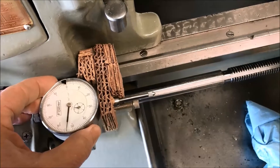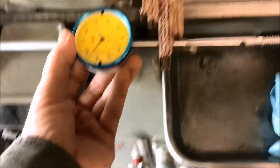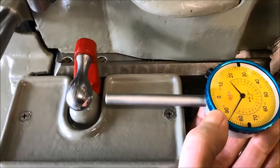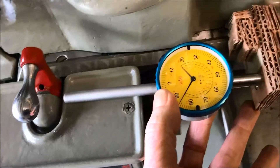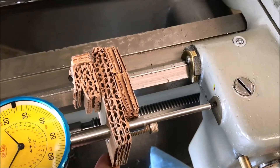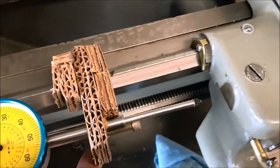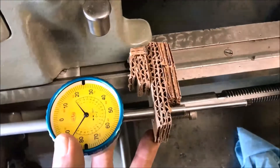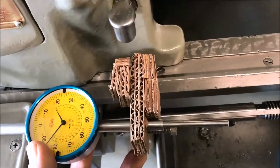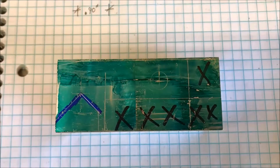Let's see how it looks with the longer indicator. The two-inch travel indicator is going to function something like this. I had to make sure I was high enough to clear the gearbox back here and also still make contact with the machine pad on the carriage or saddle. Anyway, that's kind of my plan — I'm designing this as I go, so I don't know what's going to happen. Let's just keep moving and see what we end up with.